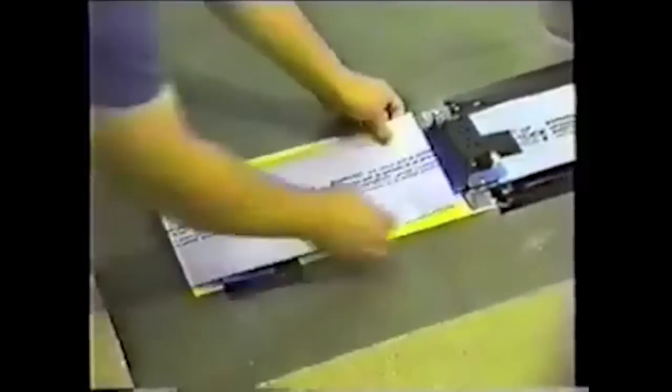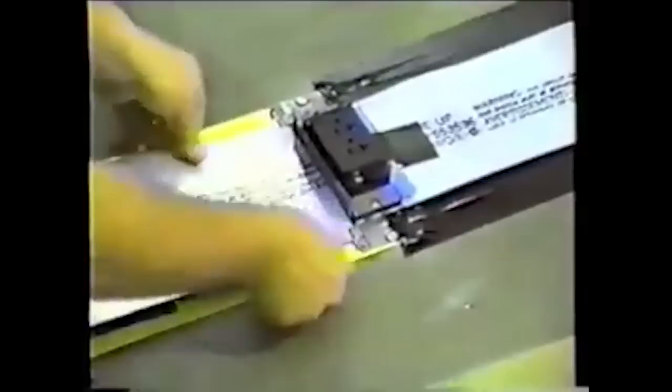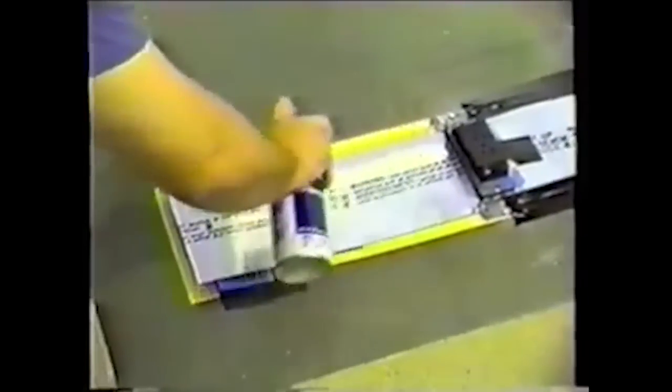Install a new section of top shield over the insulator patch at the end of the cable installation, terminating one end of the top shield to the base plate stainless steel bonding clips. Spray and edge tape the edges and the end of the installed top shield to the floor. Install DCR receptacles in new floor fitting locations.